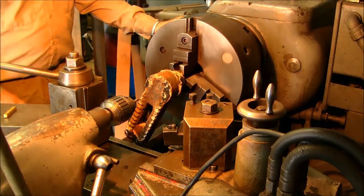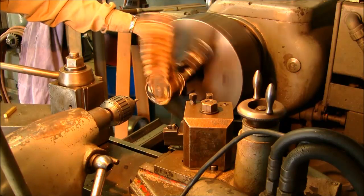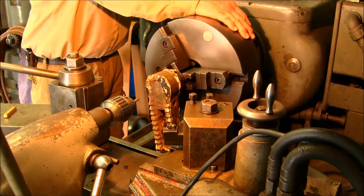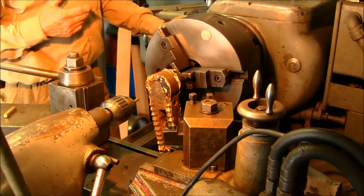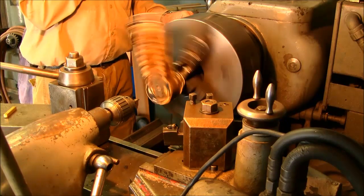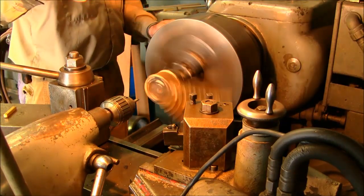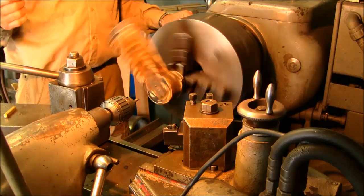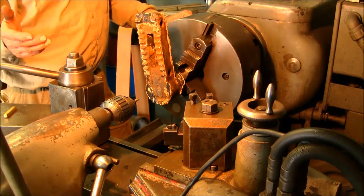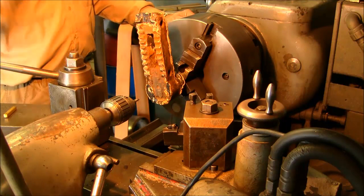Now I'm just going to swing this around 133 here. That's more than enough. I'm going to kick it up a little bit here, and you want to know what your limit is. When you start getting a little motion, you can see my light right here, and you can see how that shakes. I don't have this lathe mounted down hard because I don't have any concrete underneath. This is set on plates, and then the plates are set on a mortar floor. This was a homeowner's garage at one time.